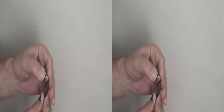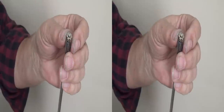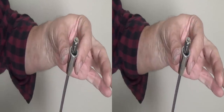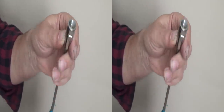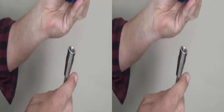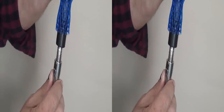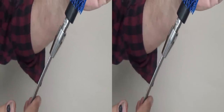You've got to separate the wires and start feeding them into the little recesses. I've raised the bronze piece and the cone up just a slight bit so you can see each one is where it's supposed to be. Then you take the fitting and slide it up and tighten it — you can see the parts inside. I'm installing this on the backstay insulator. I'll then use Loctite to install it on, though I'm not tightening it right now. And that's all there is to putting one of these together.